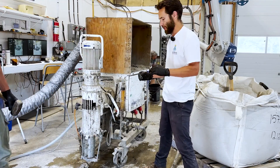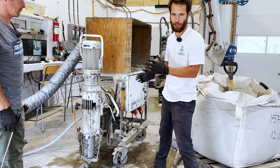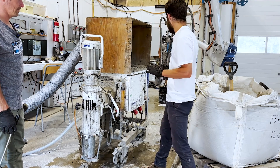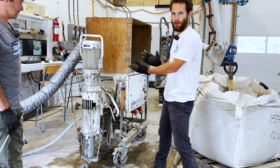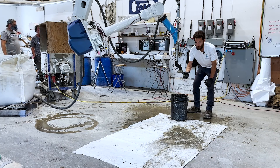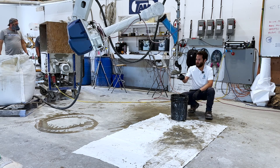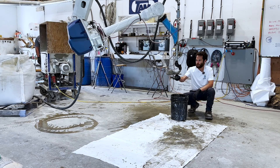At this point we have the hose plugged in. We're just waiting for the material to work its way all the way through the hose so we can confirm its printability at the extruder point, then PP to main from the pendant production window and get going. Before you start printing, you want to give it some back pressure to make sure the hose doesn't have any air pockets in it. Then you can simulate the motion of each layer to ensure that it's buildable and each layer will support the next.